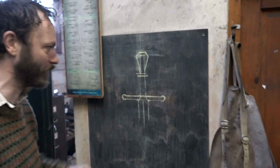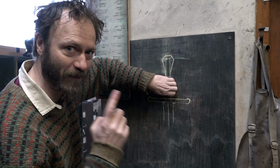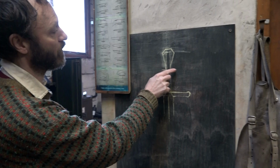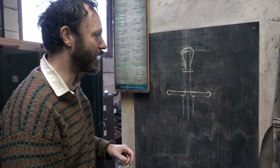Now, we've also had the conversation about what size should the entire thing be. Now, this is going to be a bastard sword, and a hand goes there up against the quillons, and don't forget that we've got to take into account the fact that it's going to be wearing gauntlets, so my hands will be slightly bigger, though exactly how much bigger, we don't really know. And the other hand is going to be gripping on the end of the grip plus the pommel. And of course you can actually put the fat part of the pommel into the centre of the lower hand and use the sword that way. How much room should we leave? It's all a matter of judgement.